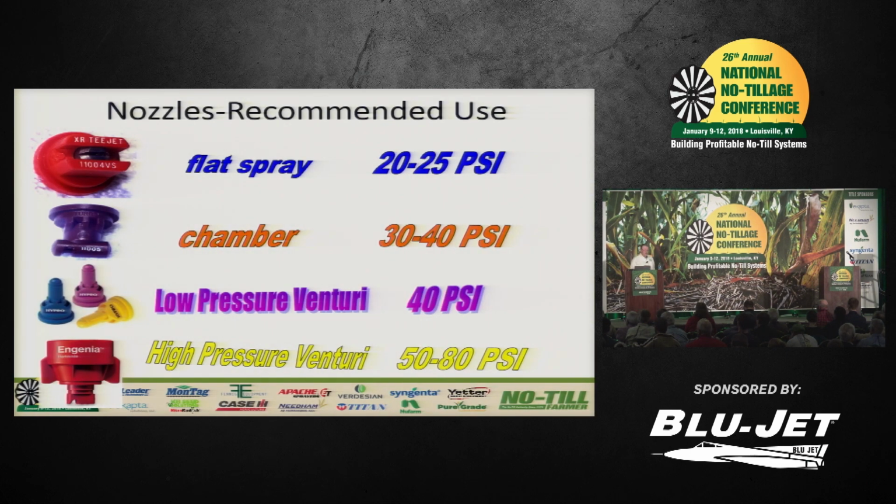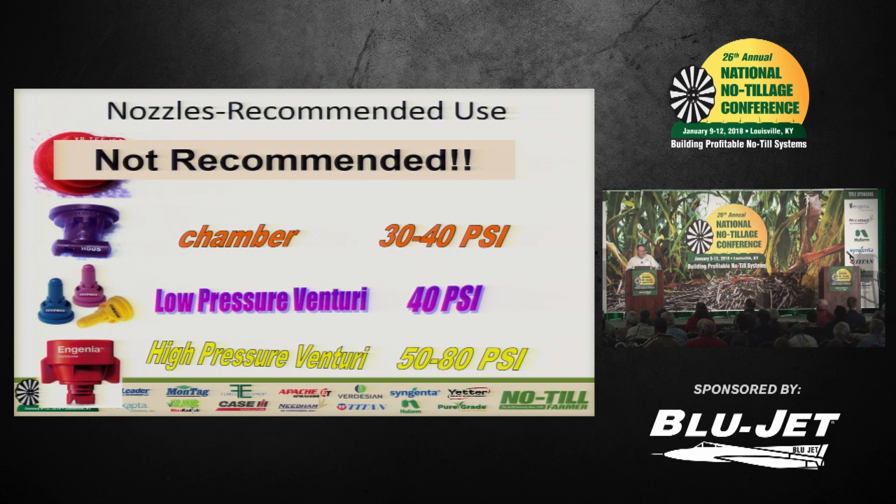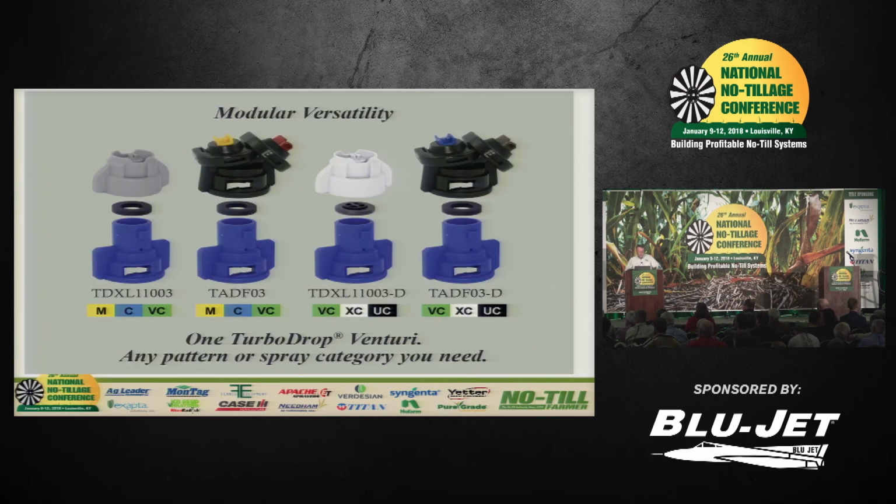Okay, as I finish. Nozzles, XR not recommended. I should cross it out sooner so you aren't reminded it's on there. Chamber nozzle, Turbo T, pressure 30 to 40. The low pressure Venturi is 40 to 50, and the high pressure is 50 to 80 or even higher in some cases. Now, a few nozzles, odds and ends as we finish up.